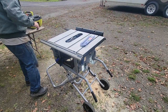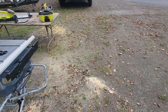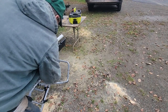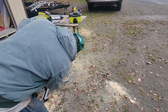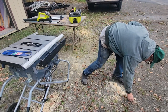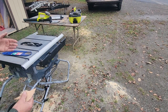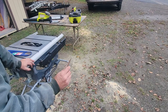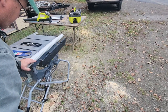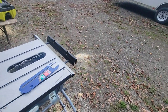We got a couple of problems with the design of the saw. Around the back here, there's a lot of sawdust and chips that get stuck in the bottom. It's designed to have a vacuum on it, and if you don't put a vacuum on there they build up in the bottom. Here's a pile that was stuck in the bottom - when that builds up the sawdust gets thrown up in your eyes, and little slivers get stuck down in there all the time.